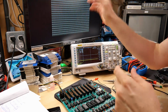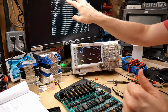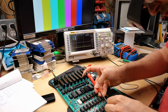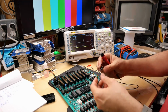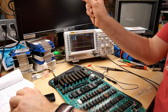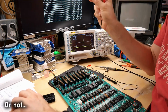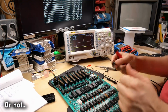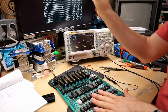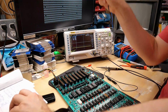There we go. Okay, so anyways, we saw on that first test with the TV set on part 1, there were occasionally slashes and a few other things. And if I pop out one of the low bank RAM chips here, which looks okay, good, nothing bad, we might see something different, because I think it's this low bank. Yep, we're getting some garbage there, and that's because this chip is out. So the video decoding circuitry is reading memory to get the characters out of this RAM, and now we're getting some strange characters because of course that chip is missing.